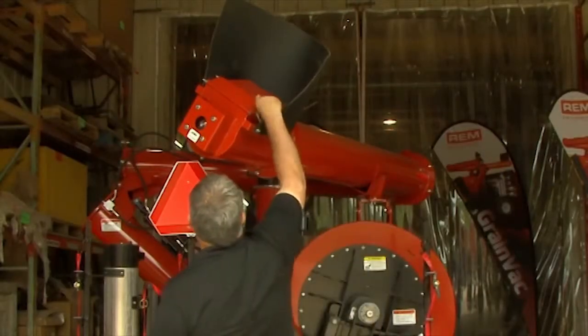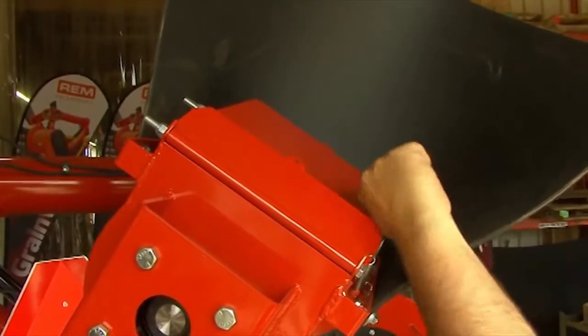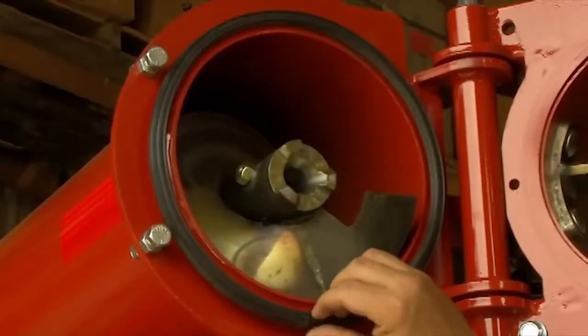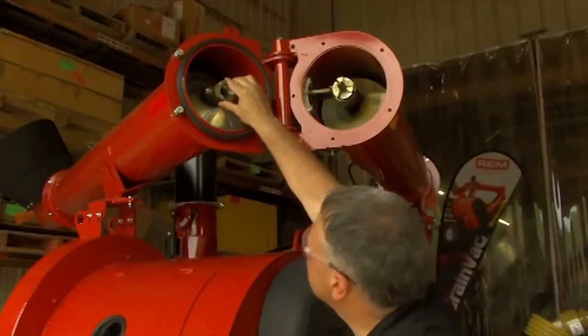You will be measuring the tension of the end-dump double doors every 100 hours or so, but as you walk by, check them both to ensure that they are snapping shut. Take a good look at the end-dump where your augers join — the rubber seal should be in good shape with no gaps, and the drive dogs should not show any signs of wear.